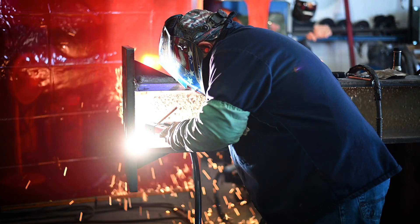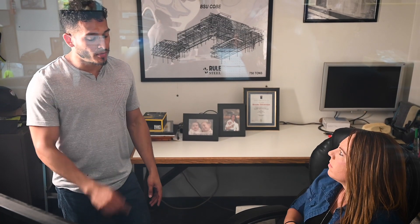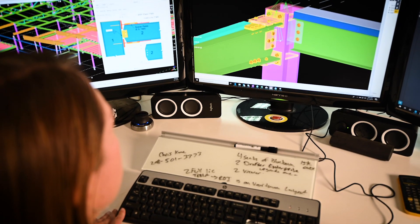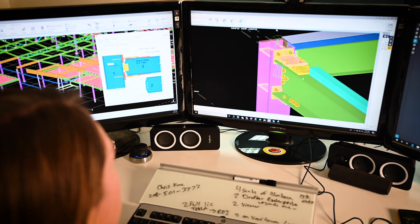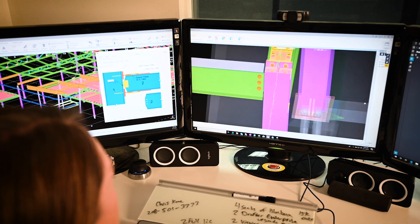When we were ready to start detailing the project, I had my detailer get in contact with Simpson to go over how to bring the plug-in into Tekla. With the plug-in, you open up the component, there's a drop-down menu, you select the yield link number that matches the Simpson drawing and apply it — and there's the connection. There was no extra work needed as far as inputting any information. It was just boom, there it was.